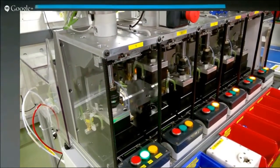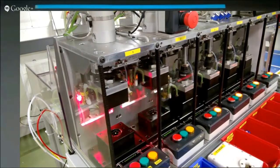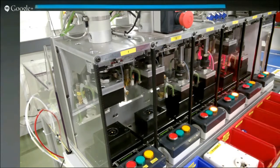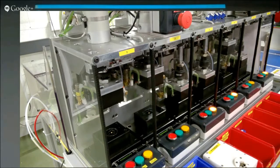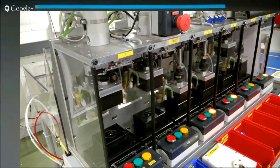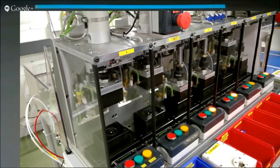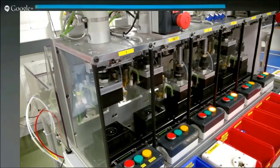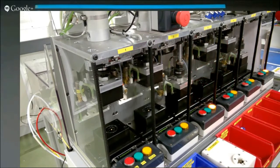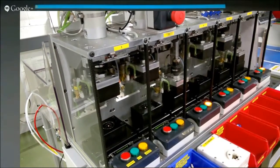When tests are finished, the sensors have a little bar on the bottom, and that white box is just taking the bar off the bottom of the sensor, which is part of the measurement system. The red light flashing at the back is the scanner trying to scan because the light guard has been broken — it's checking if there's something in there. If there's nothing, it times out after a certain time and goes into a wait state.